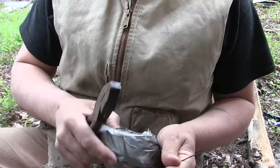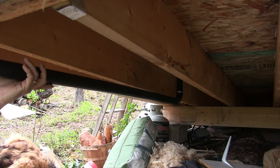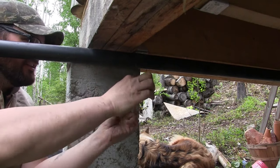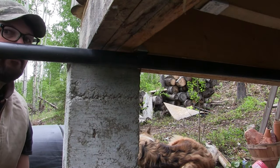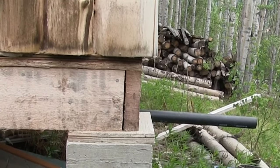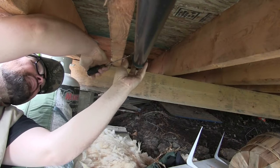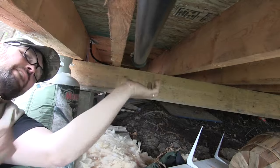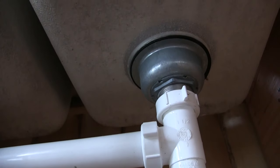I'm gonna hook the exit pipe up to that. I'll just take a chunk of tie wire and make myself a cradle. I'll take my ABS and feed it into the coupling — doesn't have to be perfect, just needs to be in the ballpark — and resting my ABS on the shoulder, I'll run a chunk of tie wire through this floor joist and put a couple twists in it and nip off the excess. There's a view of the pipe off the corner of the house. The finished product: the pipe exits through the floor, goes out our 90, out to the outside, and comes up to meet this rubber clamp adapter, right into the two sink bowls.